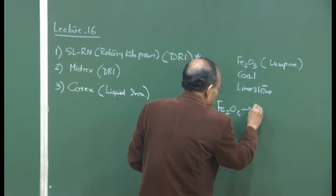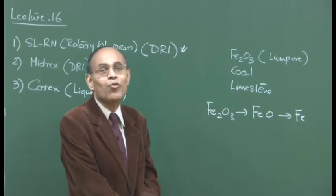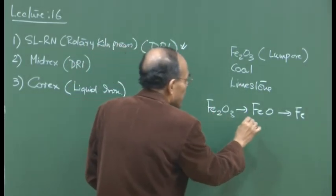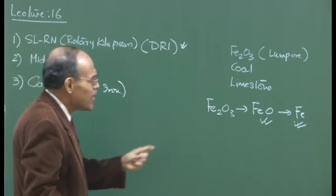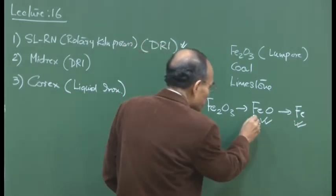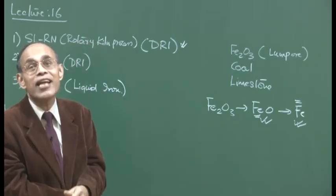And in that context, I would like to tell you that we will not be getting complete metallization here. Complete reduction is not going to be possible. So basically, what we are going to get after the process is a product which will be containing a mixture of predominantly FeO and some Fe. That Fe, in the context of iron making, which is free Fe, is often termed as the metallic Fe. And if you sum up this Fe and this Fe, that is what is called the total Fe. And these two parameters determine how good the DRI is.